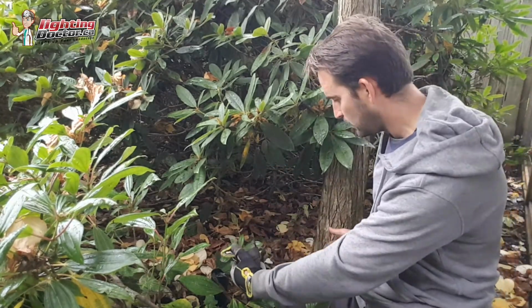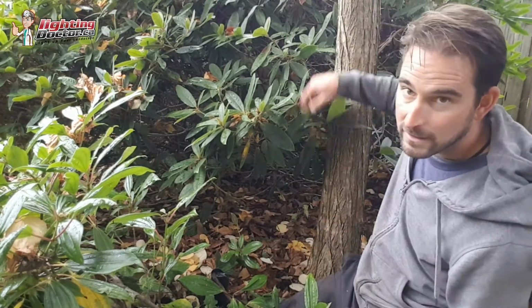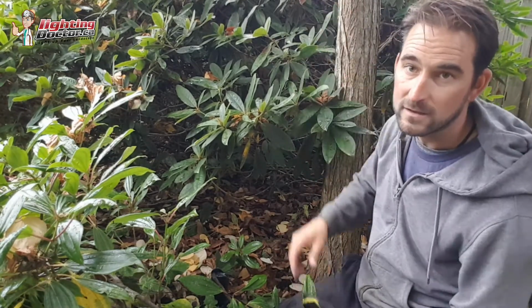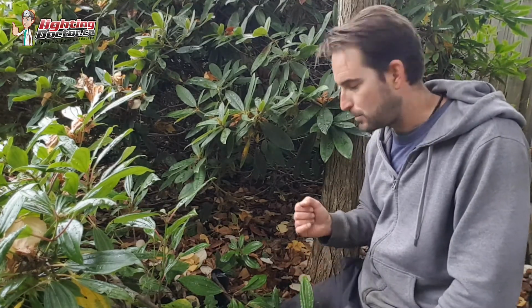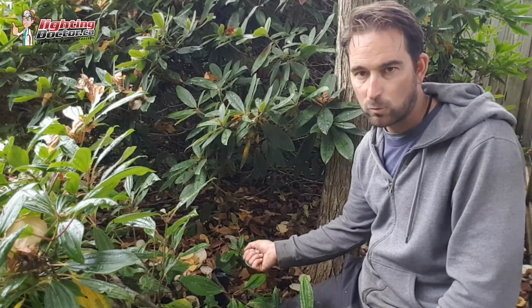That's why I like having it closer to the tree. Here we're maybe 12, 14, 18 inches away from the base, and we're going to have it shooting almost straight up because I want to highlight as much of this trunking and branching structure as possible, as well as now we're getting that light up into the foliage and into the canopy. So again, with our standard RS uplight from FX Luminaire, there's lots of other good ones out there. I like this guy because it's a real workhorse, and that's what we're going to use on this project.